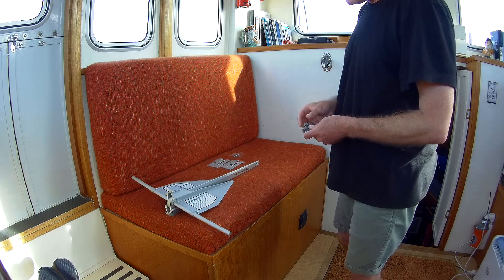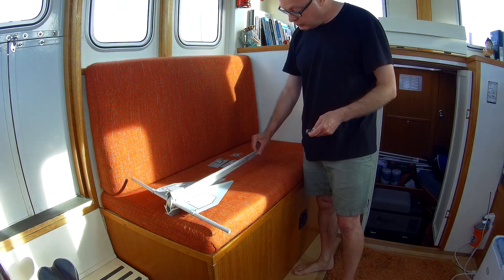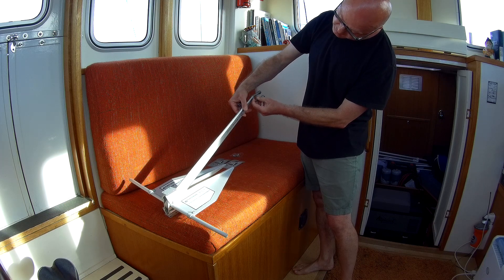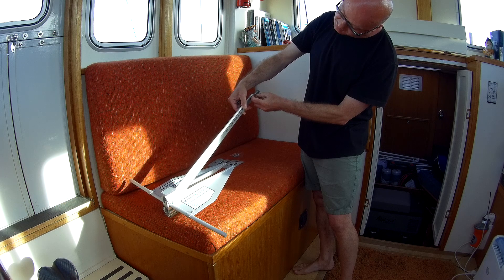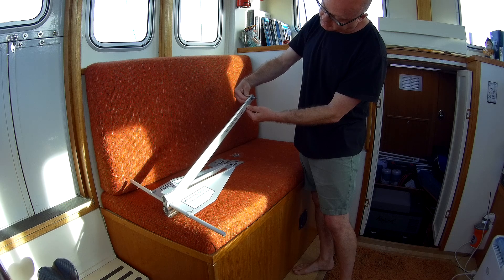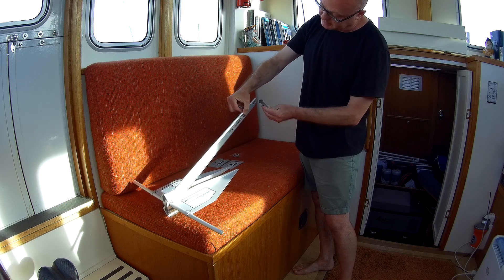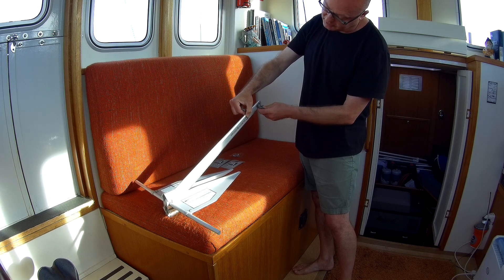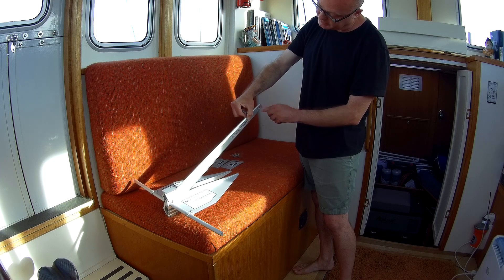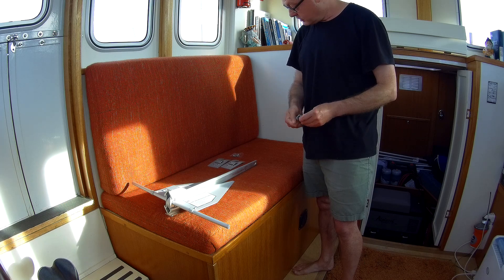The only other thing I'd add: when you're attaching your shackle, don't attach it like that because then you've got the two edges cutting into the shackle. The correct way is to have the pin oriented so you've got a flat mating surface. If you put it in the other way you haven't got a flat mating surface, which will more quickly wear away that edge. So that is the correct way to attach your shackle.